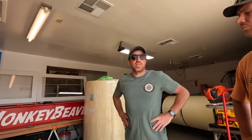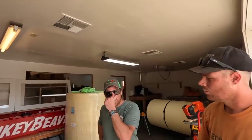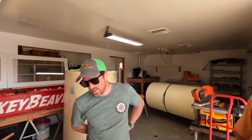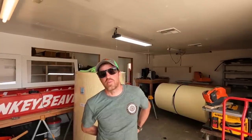Now, are we going to do custom orders? Yeah, what's the best way for... Don't use the website. Just call and talk to somebody or email. If you want something with multiple rings or a ridiculous length or bigger, we're probably going to stock half inch, 5/8, and 3/4, but there's no reason we can't do 1 inch. We'll probably keep some on hand. We probably won't keep them spliced up. We'll probably just keep some material on hand for some big slings.